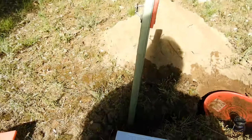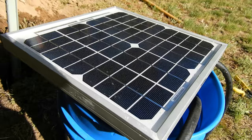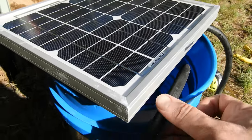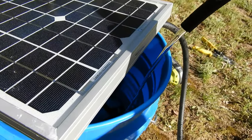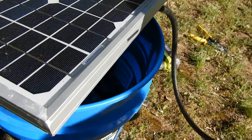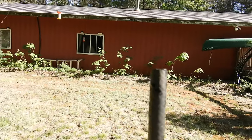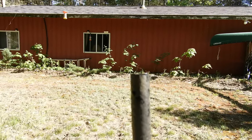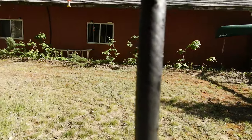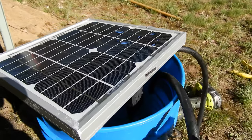It's going to pump it up in the sun and into the birdbath, which will be relocated over here. And here's the solar cell that is going to run the whole thing. It's a little bit overkill for just a pump, but it keeps working quite handily. It's going to have to pump upwards quite a bit from that hole to the top. Let's see if it'll make it - I think it will make it eventually. You can see it has to have a lot of head to make here. I hope this is going to work. It looks like I had plenty of flow, but I may not have enough head.